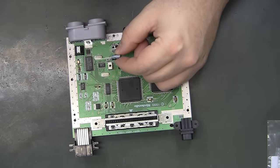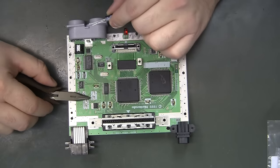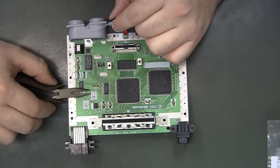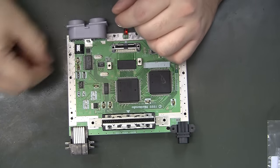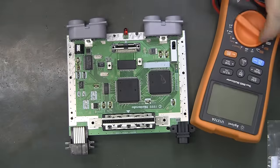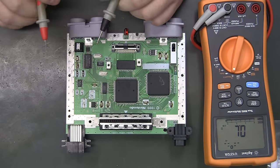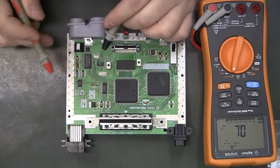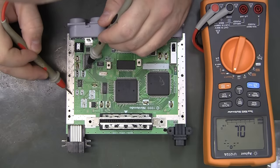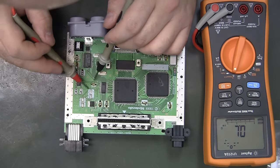Now these are polarized, which means you need to remember what's negative and what's positive. And they kind of give you some sense of that with this white square here. See the corners there. And as always, if you just forget, take your multimeter out. Set it for continuity. Well, that ain't gonna work here. Well, it will work, actually. What you can do is test for ground on another capacitor, and you can tell that the corners that have been beveled are the positive.